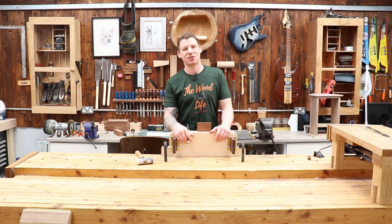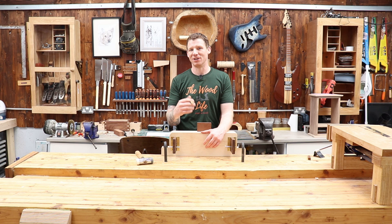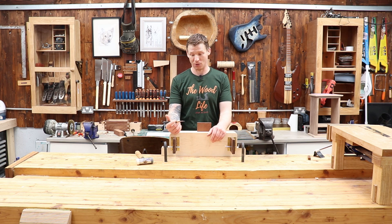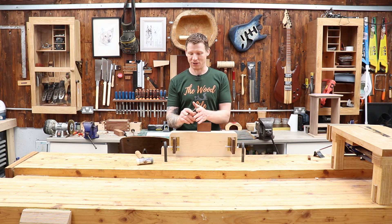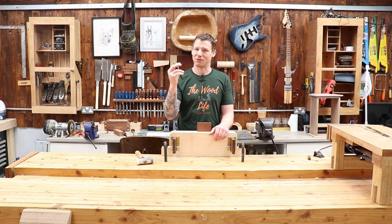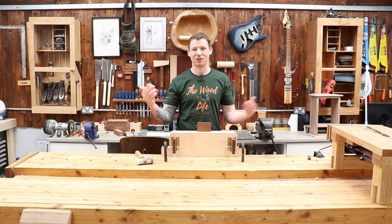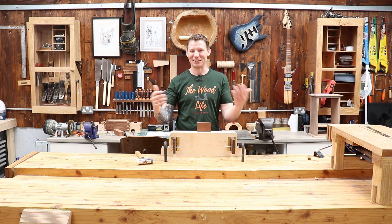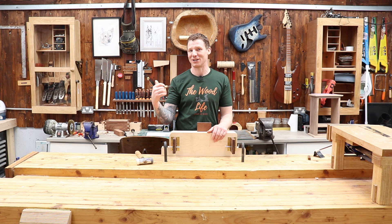That's a quick demonstration using it as a marking knife. These fine blades allow you to be really accurate - the only thing to watch is tracking the grain, but a couple of light passes then a heavier pass more or less solves that. If you like really fine pins on your dovetails, a knife like this is exactly what you want because you can get in there and it's ambidextrous - left and right-handed, just a case of flipping the blade around. The balance point is spot on and it's just nice to hold between your fingers.